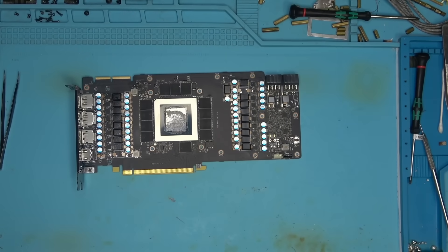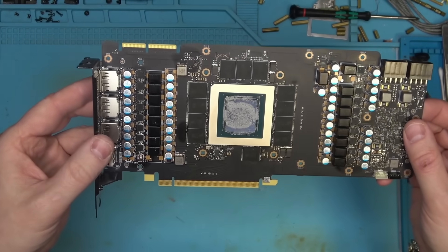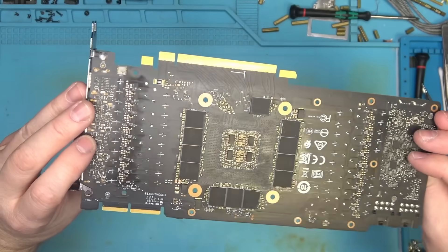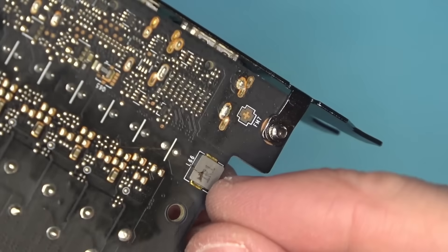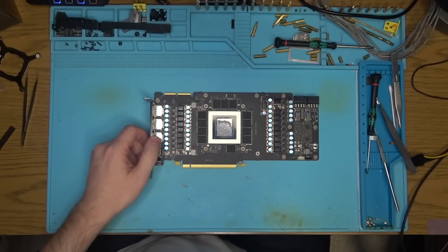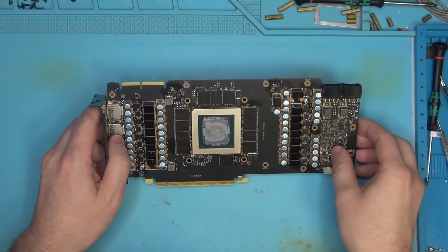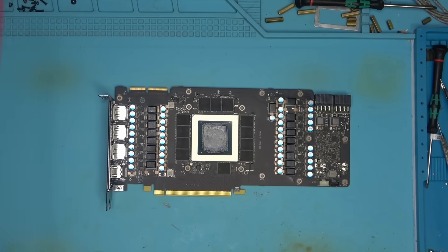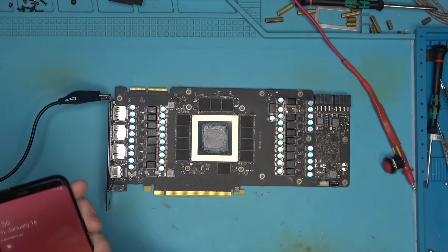Regardless, we have a short. I think we have a blown driver MOSFET - those are the ones that fail most of the time. We also have a cracked coil - this coil here needs to go, it cracked right there. The coil would have been saved if there was a fuse, but MSI ran out of fuses for this particular card. Let's give this thing 1V and see what's warming up. My guess it's going to be one of the driver MOSFETs. Hopefully it's an easy fix because I don't want any serious damage on this card.